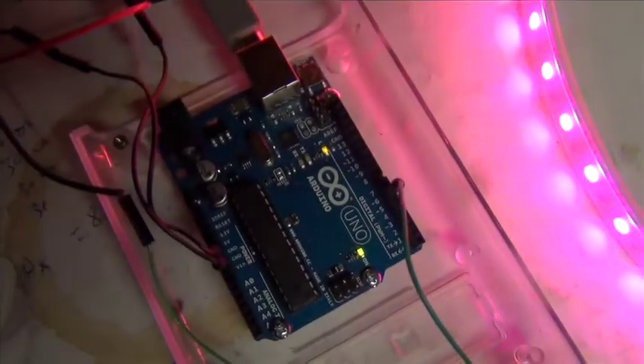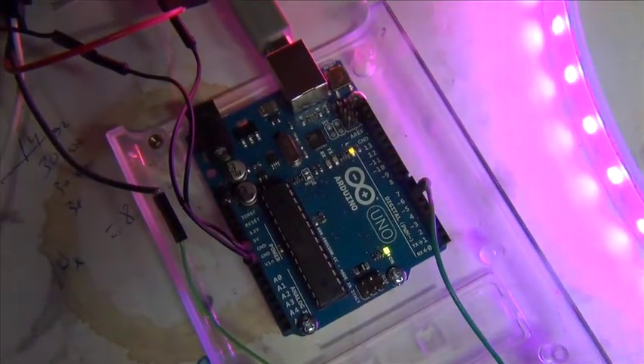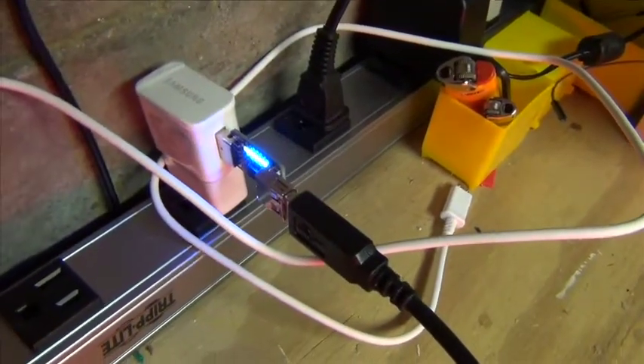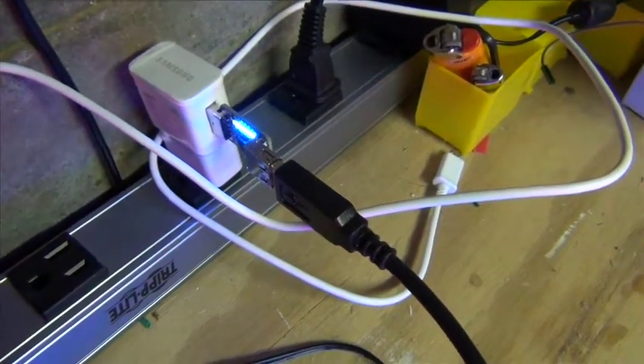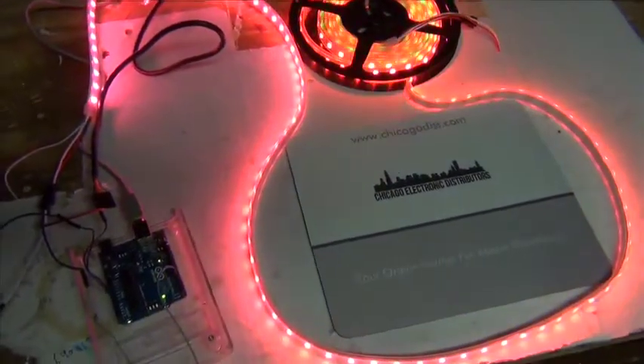It's hooked up using just basically one pin of the Arduino. You've got two ground pins hooked up. We're using an FTDI cable to power it, just because you get 5 volts. And as you can see, we're even using an Adafruit USB power meter that we're maxing out — this thing's drawing 2 amps. It would draw more if we would let it.